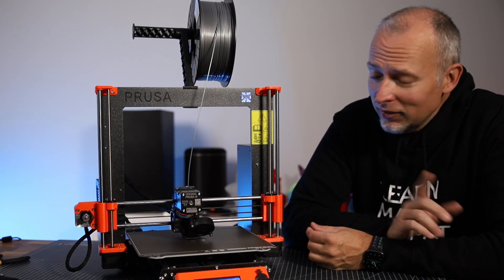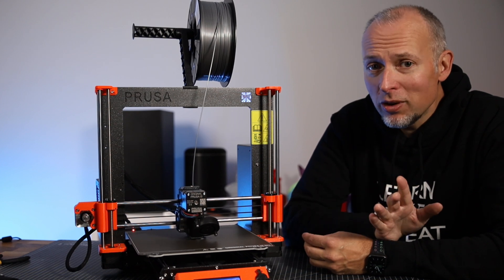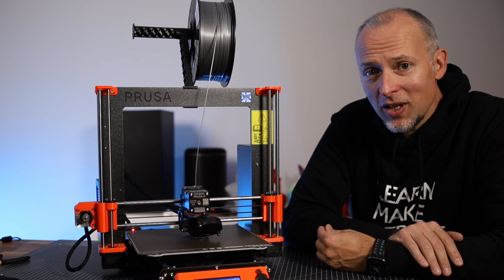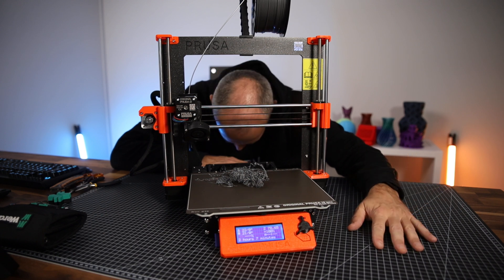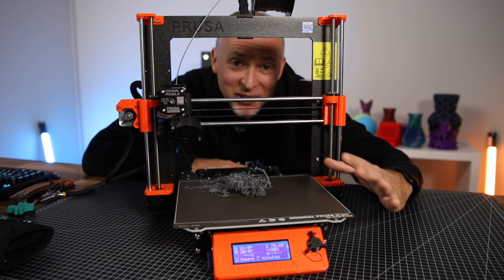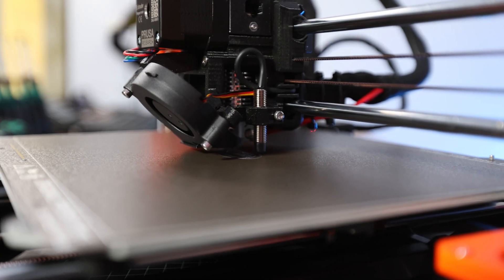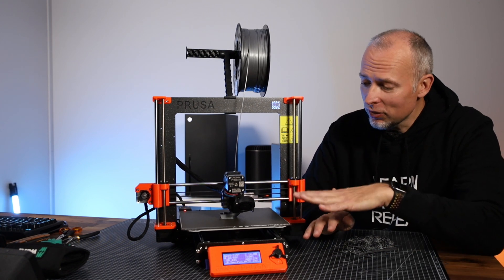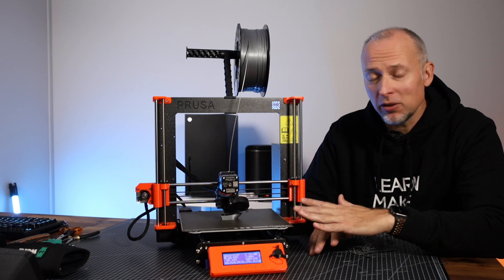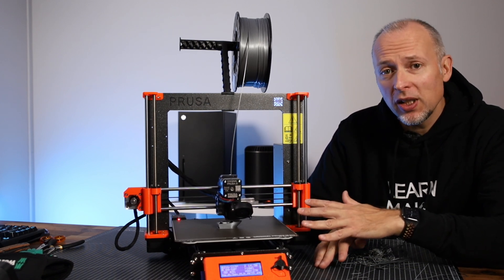One thing I realized pretty soon when this started is that it's probably not printing with the fastest profile available. It says on the SD card this is going to take two hours, which is quite long for a Benchy — very conservative settings at 0.15 millimeters. So this is what you get if you leave the printer for lunch break. Let's do this one more time, but this time I'm gonna clean the surface a bit with alcohol. After doing another calibration and making sure the first layer sticks super nicely and cleaning the bed with alcohol, this second try looks much better. I also changed the print settings to 0.3mm with a faster profile because I didn't want to wait another two hours.